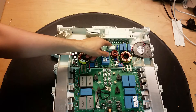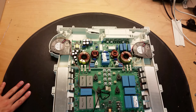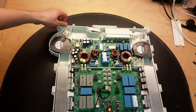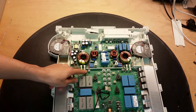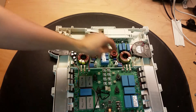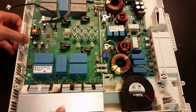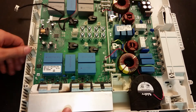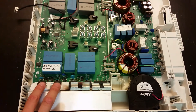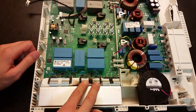I thought this was three-phase L1, L2, L3 - but L3 isn't connected anywhere. Now I understand why they use this configuration - it runs on two phases. We've got these bridges which are actually fuse holders but they've got a pipe in there instead of a fuse. We've got fans here that blow air over the heat sink. On the circuit board there's no huge capacitor for smoothing the input, just a small one, which means there's still a 100 Hz ripple that makes the transistors dissipate a bit less power.